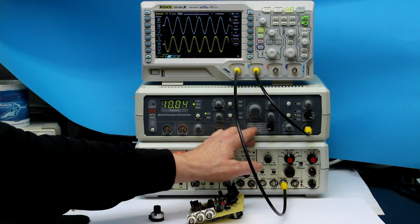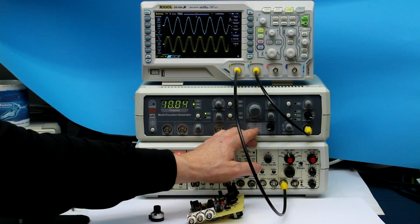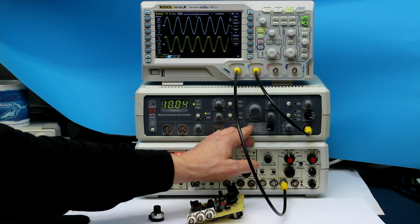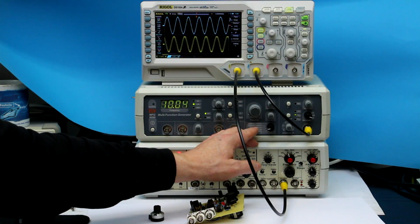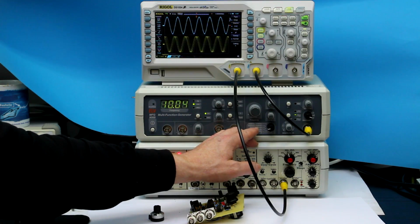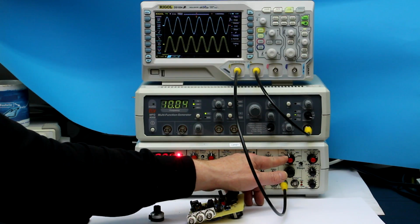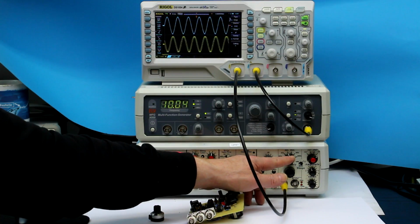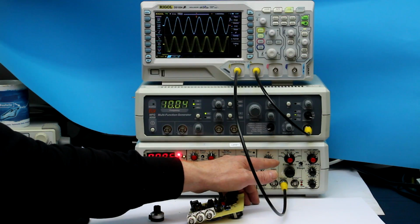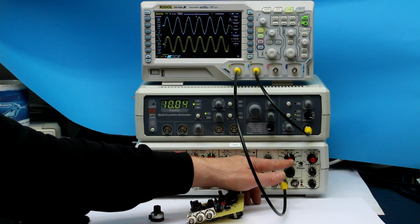And then the other settings go by a factor of 100. So for example, here you have a range from 1 kilohertz to 100 kilohertz, and the next is from 100 kilohertz to 10 megahertz. So what if you want to sweep, let's say, from 50 kilohertz to 2 megahertz? Then you are between the ranges. What I did, I made 6 ranges differing by a factor of 10, so that you always have a 1 in 600 sweep ratio between the lowest and the highest settable frequency.